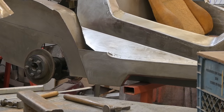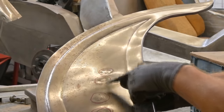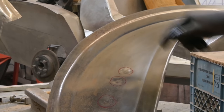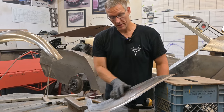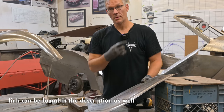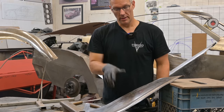I just worked on the middle one — this one here. You can see it's almost gone. We have a little crease happening there, and this one's still quite significant, and so are these. So we're going to work these out. The wrinkle that we had here is almost gone, and this curvature is returning. We have a bit of a dish in this area, so that will come up when we address it. I'm going to be using a series of on and off dolly techniques to work this area — bring up the lows and bring down the highs. After we finish this panel, if you want to fully understand on and off dolly techniques, click that little card up above. It'll take you to a video we created about a year ago on on and off dolly techniques using transparent sheet metal, and that'll really give you an understanding of what's going on here when I'm working these dents out.